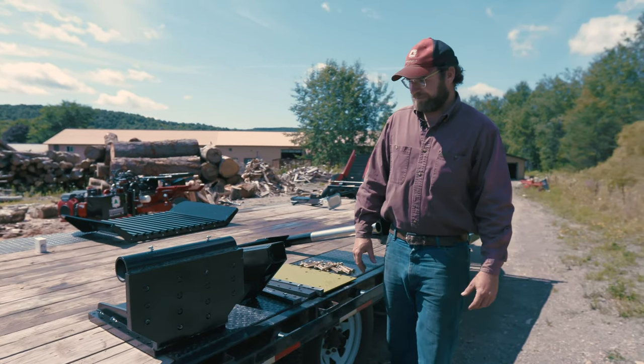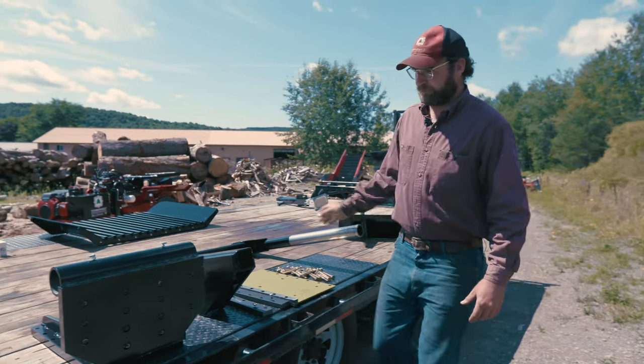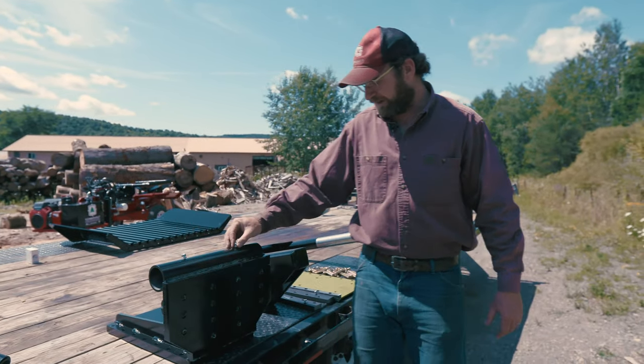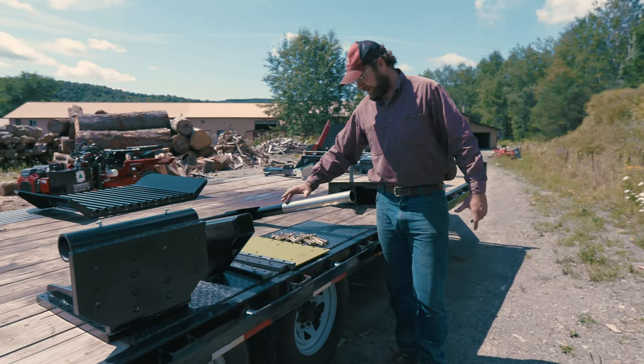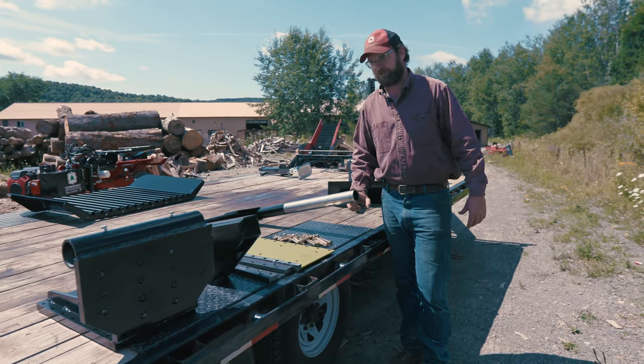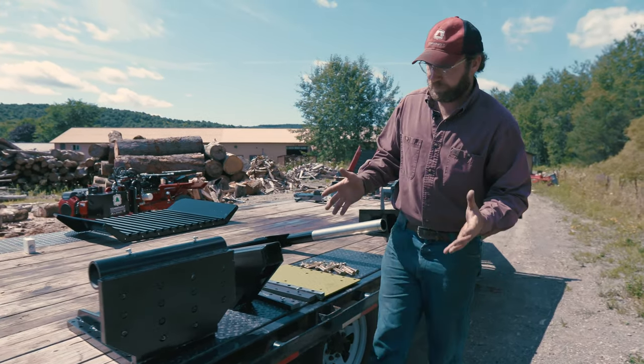When you have the box wedge installed, you're also going to have this pullback arm, which slides through this tube on the push block. You notice the grease fittings there and the precision machining here. That's all done in-house with our snap ring grooves that hold it into place. Let's talk about a little bit of these individual components, starting with the push block.